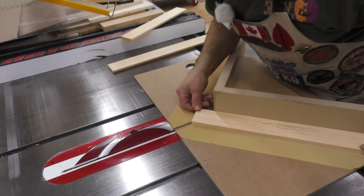And just to avoid any tear at that end, I just kind of try to slide it off so you're doing kind of a slicing cut. And that usually prevents, or helps to prevent, breaking fibers at the end. And I'm only worried about the ones on that plywood. Same thing, I'm sticking up above here. I'm flush there, so I'll clean this off first.